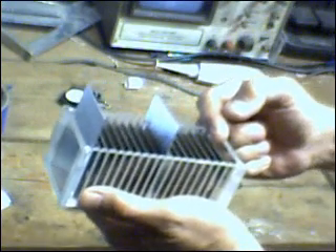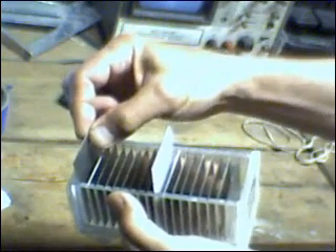The plates that you see extending beyond — I know why: it's because I forgot to take the plastic backing off the plates. Anyway, getting back to what I was saying: the plates on the end and the middle are where I attach my electrodes to the electrolyzer. The middle is negative and the two outer plates become positive. The extension of the plates above the surface of the neutral plates in between gives me a good large surface area to put nice heavy-duty electrical clamps on it, to get a good electrical connection and deliver a lot of current to this if I desire to test at high current.